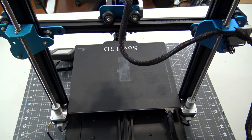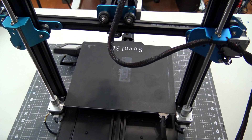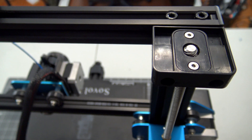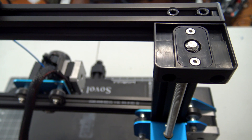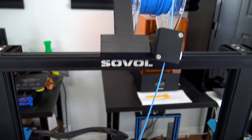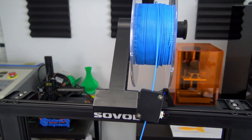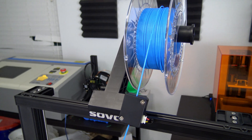The x-axis is supported by dual z-axis motors, making the z-axis very stable. The two lead screws have bearing supports at the top. The spool holder is located on top of the printer, where the filament detector is also located. When it detects filament has run out, it will pause the print and prompt you to switch filaments, then resume where it left off.